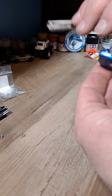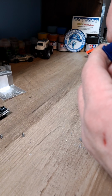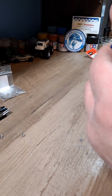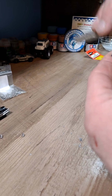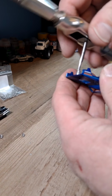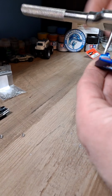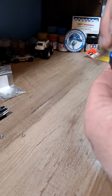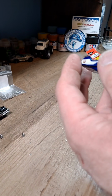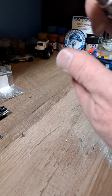You might be able to drill it out, but at that point, you're better off just epoxying the chassis back together or something instead of fighting with trying to drill out a hardened steel tap. So, and you can tell, you feel it bound up right there. That's at the end. I'm not going to force that to go in anymore. So now I'm just going to back it off all the way out, nice and easy. With this big handle I have, it's easier to do it this way and rotate the car out of the tap.